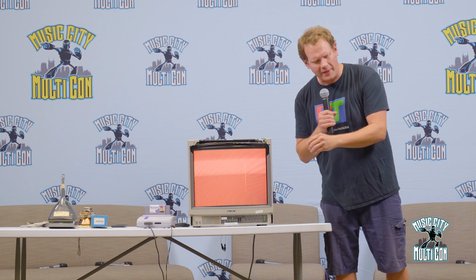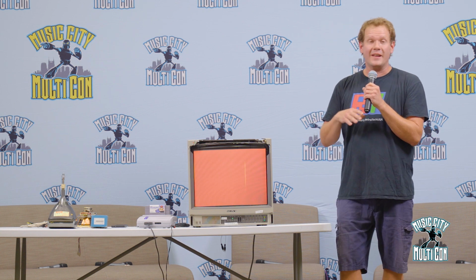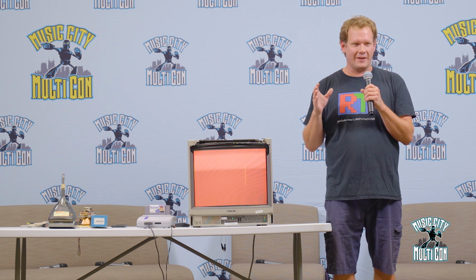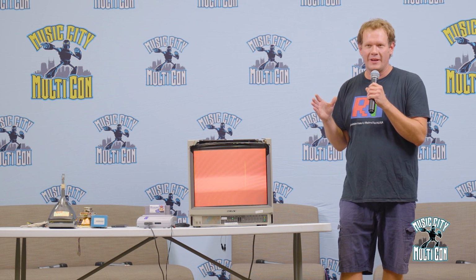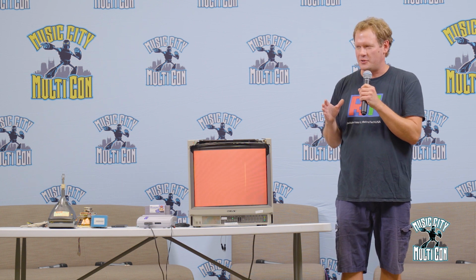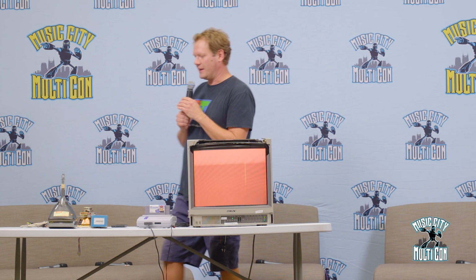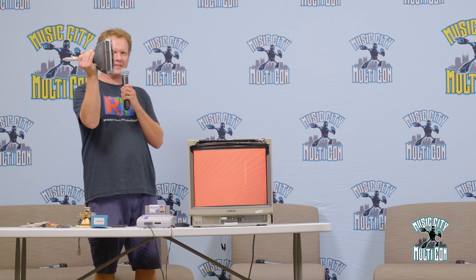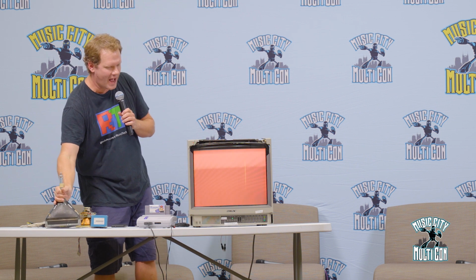Now, one more thing about the tube. There's two types of tubes: the Sony tubes and everybody else's tubes. And that's not a lie. The Trinitron tubes were a different technology that Sony made. They patented the technology, and until the patent ran out, you weren't making a Trinitron unless you made a deal with Sony. The thing that was different about Sony's is that when they came out, they only had glass curved on one edge, where you can see that. It's curved on that edge, but on this edge it's flat. So there's only one curved side.